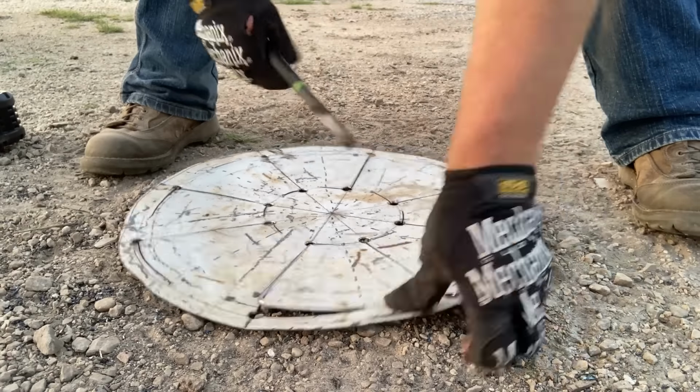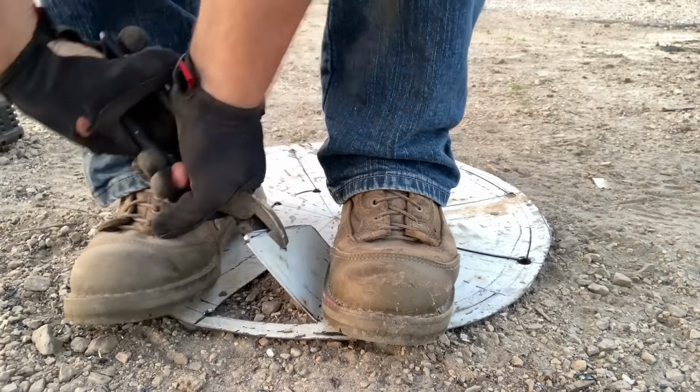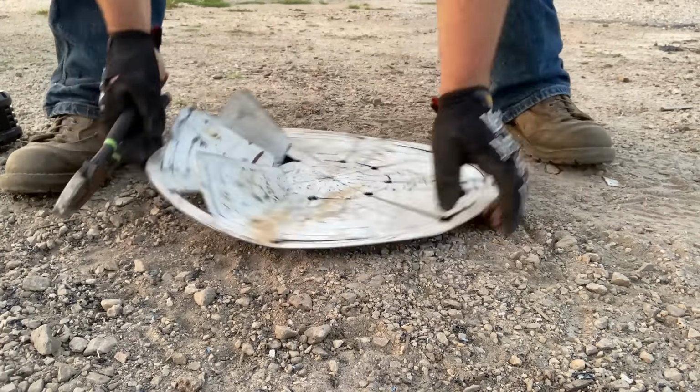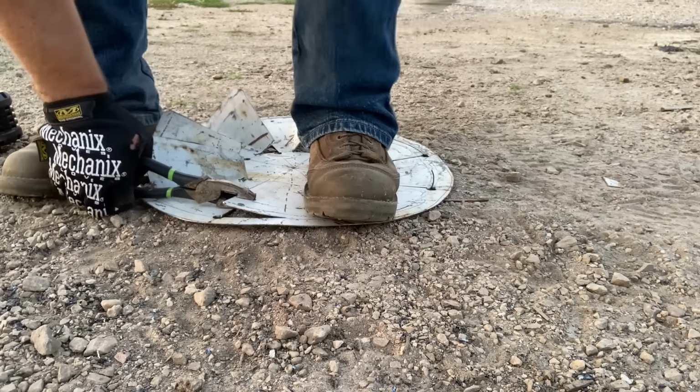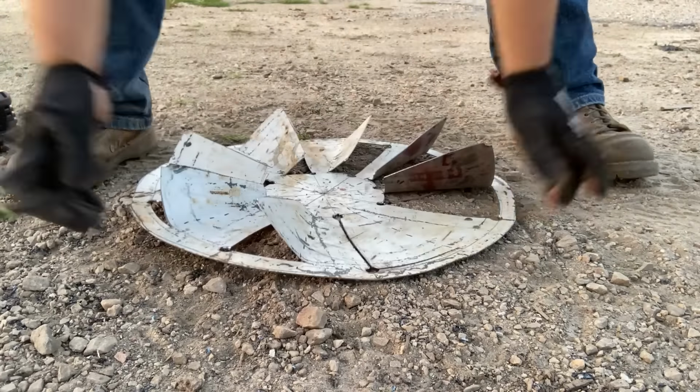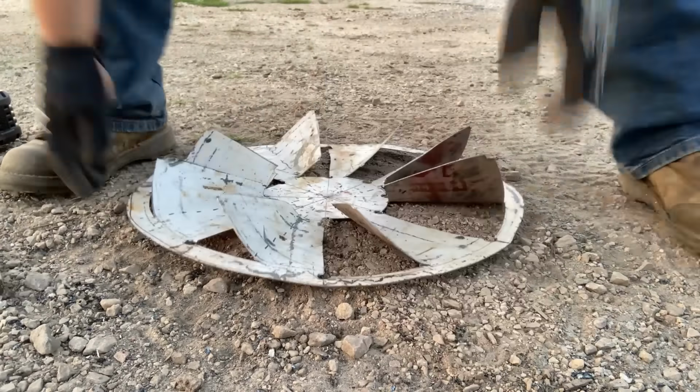Once again, some tabs that are C-shaped, and we're going to take our pliers and bend them up. This gives it a third dimension, some geometry, which not only controls the airflow and helps our burn barrel burn more efficiently, but it provides that geometry which offers some rigidity and support to the grate in the bottom of the barrel.